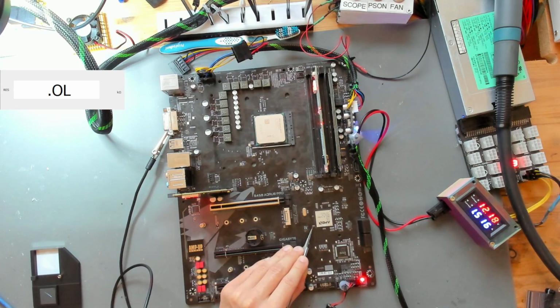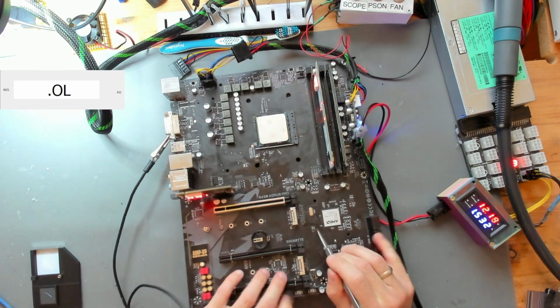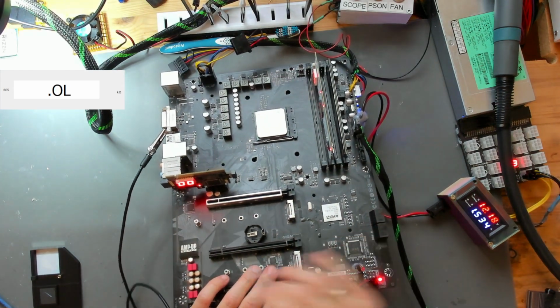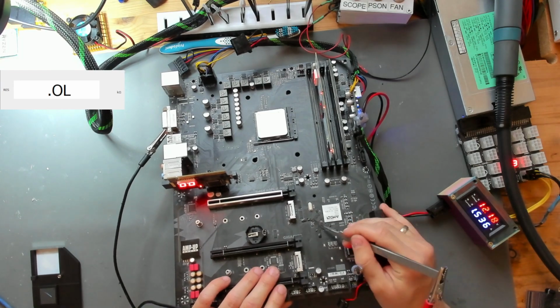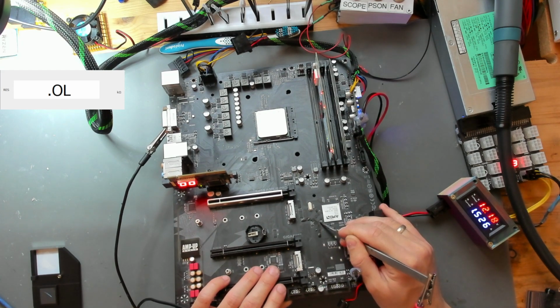And another thing that we were able to establish is, even if you try to take reset off yourself, as you can see, the red LED right here, and if we supply voltage to PCIe reset, the board takes reset off, but it doesn't go into actually starting.